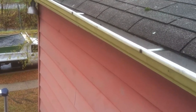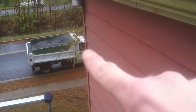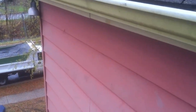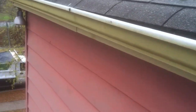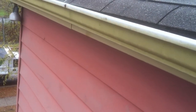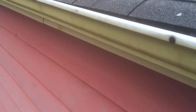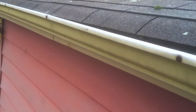The components that we use with the siding replacement are going to be J-channel, which is a piece of channel that interlocks onto the bottom side right here. You've got a corner post that runs down the outside corner. There are also some areas that will have an inside corner post. The starter strip siding goes down at the base of the siding wall. And you'll have new mounting blocks for electrical features or plumbing features on your home. All the accessories will be new and matching.